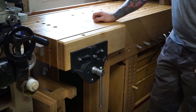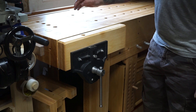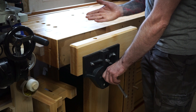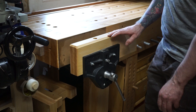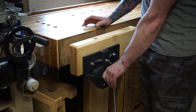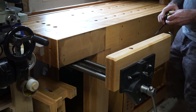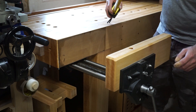Last but not least is the vice itself — this is the large quick release vice from Rutlands. The rear jaw is embedded into the front apron and the front jaw is obviously behind this front wooden jaw, or chop, or whatever you want to call it. The front apron is 65mm thick and this piece here is two inches thick, so even taking that into account I've lost nearly five inches of clamping capacity — but even so you can still see I've got an enormous amount here, basically a couple of millimetres short of a foot of clamping capacity.